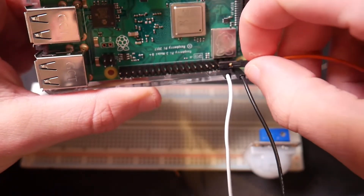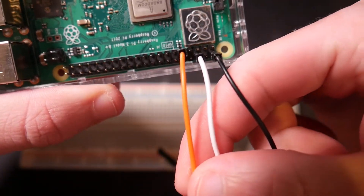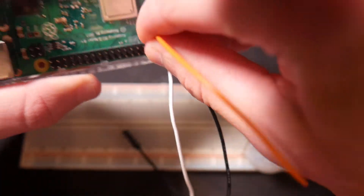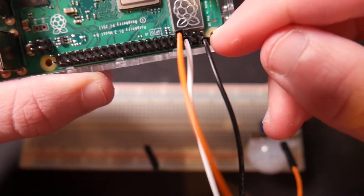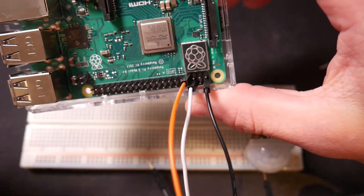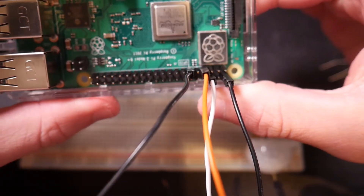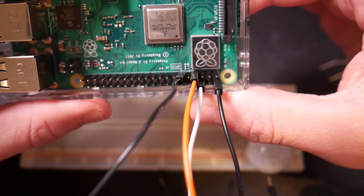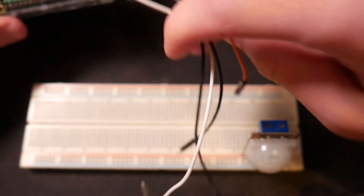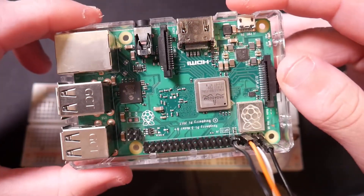Directly above the white wire and one to the left, we're going to plug into our fourth GPIO pin. I've actually plugged this one into the wrong one — it needs to go one over to the right. We're going to be plugging into that fourth pin on the top row, and then the bottom pin on the right, three over. We need one more wire — I'm going to skip one pin on this top row from our orange one and plug into our other GPIO pin. Important: make sure that the Pi is off while you're doing this, otherwise you might short a circuit and damage your Raspberry Pi.